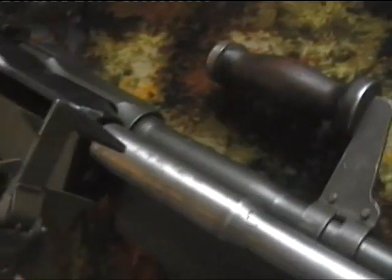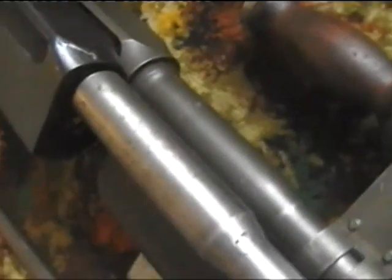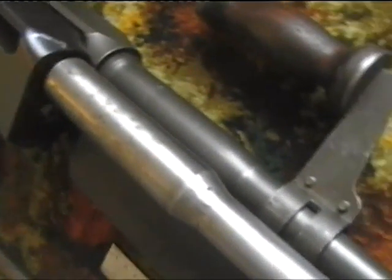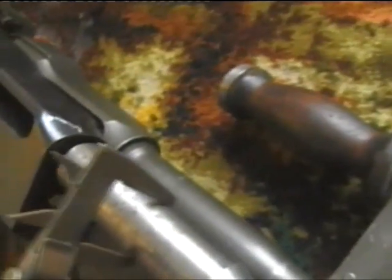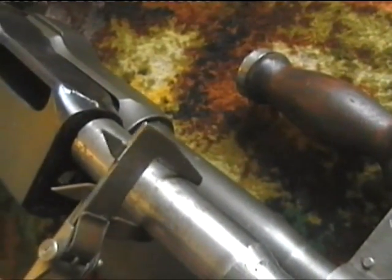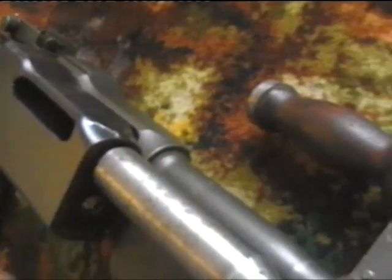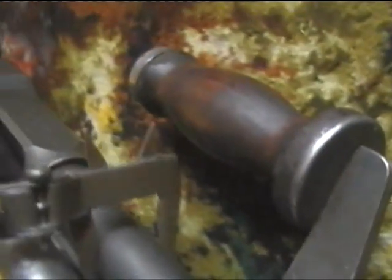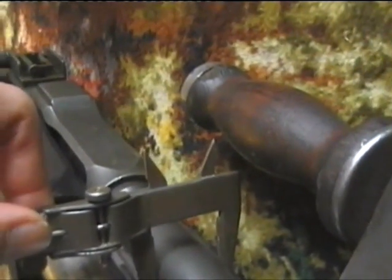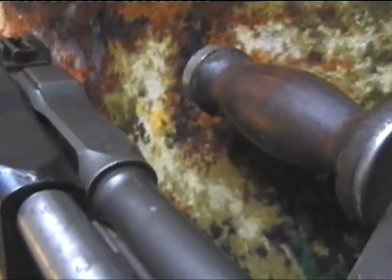What I've decided to do is I've built this piping up considerably now by laminating one pipe over another one until it's approximately the right diameters. That there is now 28 millimeters in diameter, which is within a fraction of a millimeter the same as the original one.